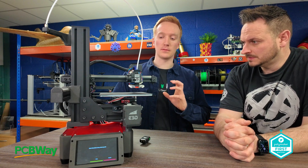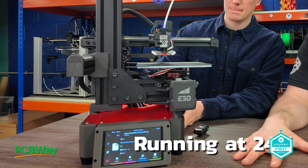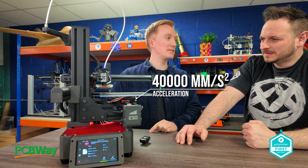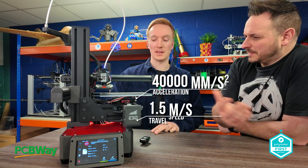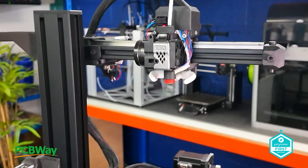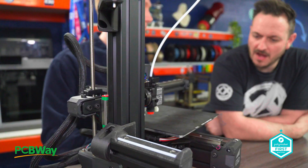Some fast moves. Because we've taken out all the mass we can from the extruder and extrusion system, we've been able to push the accelerations and movement speeds. The accelerations were 40,000 millimeters per second squared and the travel speeds were 1.5 meters per second. But we're not going to be printing at that speed necessarily — that all depends on your track width, layer heights, and what volumetric flow you can get. There's also a surprising amount of printing that isn't material deposition, it's just movement. The faster you can do that, the quicker you print, and things like stringing are much improved if you can just zip to one part of the print.